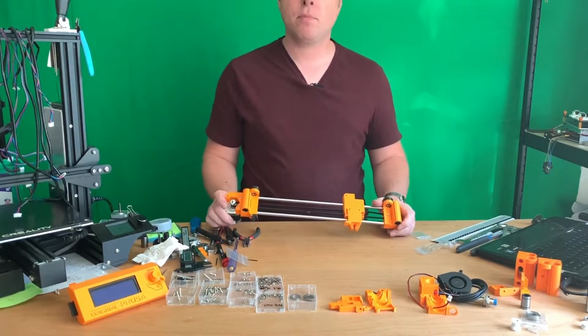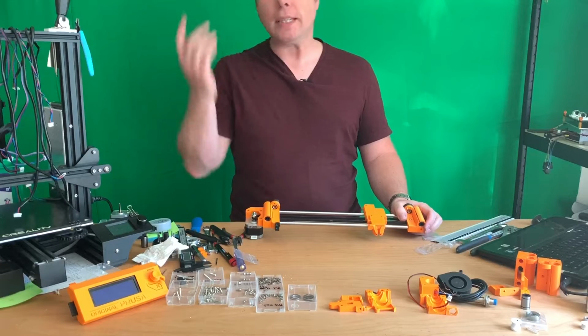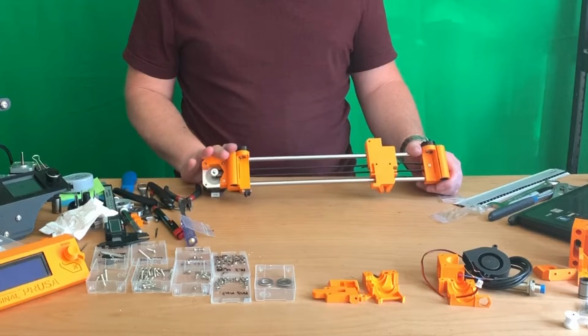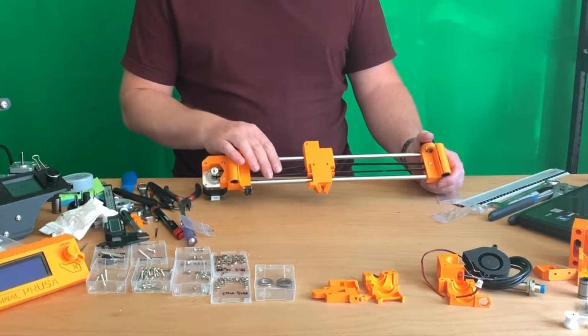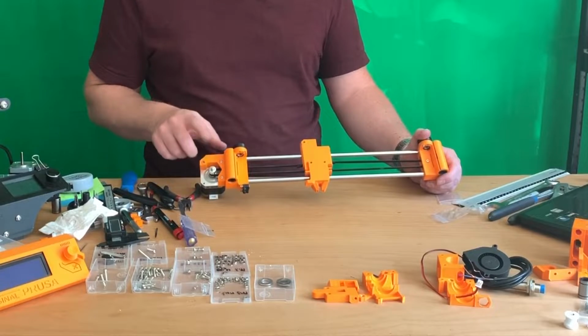During the time lapse, my memory from the iPhone was as good as full, and so the time lapse quit. So what did I do in the meantime? I added the motor part. When you're going to put the timing belt on the gantry, make sure that you only screw one of the 3 screws into the motor.